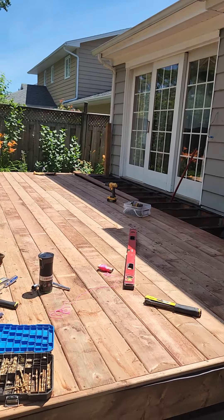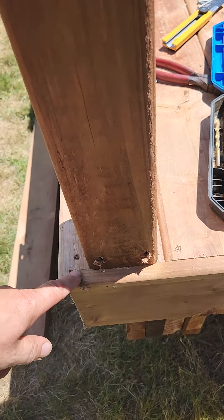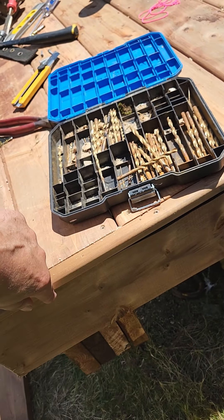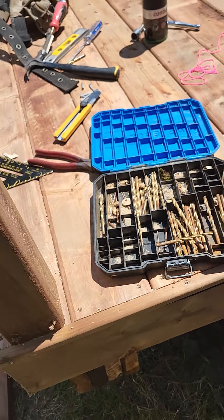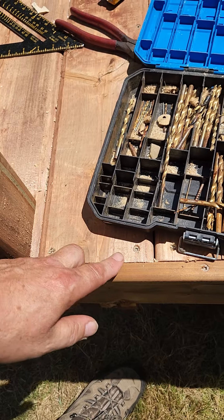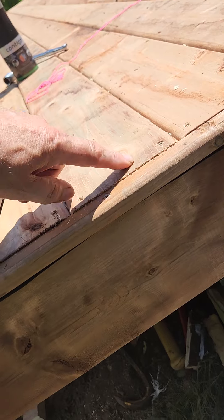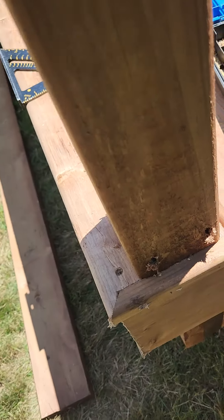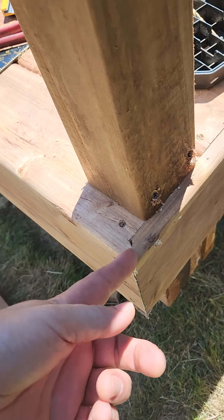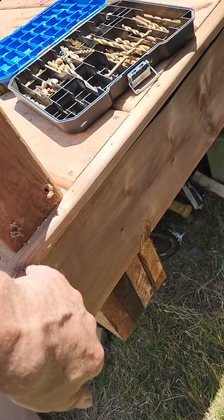So that's where I'm at right now. I got most of the deck boards down. I cut a piece of decking here with the outer factory edge on the outside — this is about seven-eighths of an inch in thickness. When I cut my deck boards they all butt up to that, so you're not looking at the cut ends of your deck boards. The very first deck board I notch out about three-quarters of an inch with a miter on the tip, and so it all looks pretty good. Put a screw in through here to pull her in tight.